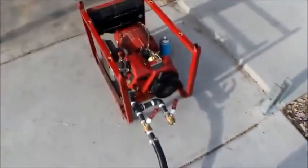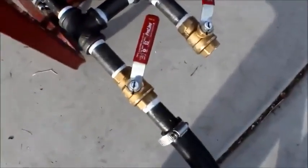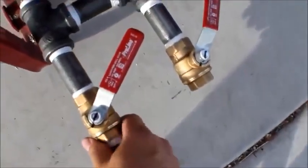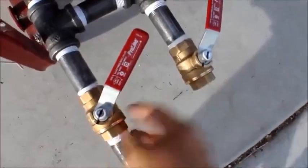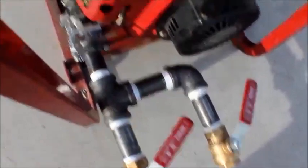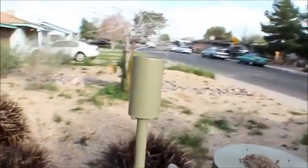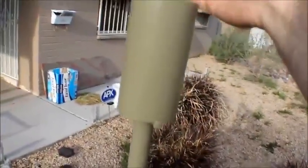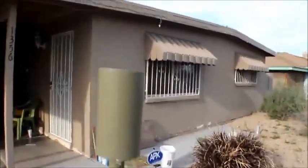Usually the gas tank sits right on top — it's completely gone. I have these marked exactly where they need to be: this is the fresh air and this is the vapor. You do need to control the air-to-fuel ratio here because it's not doing that through the jets and circuits it was designed for. It's a little breezy today but there is some smoke coming out — you can kind of see it against my house.